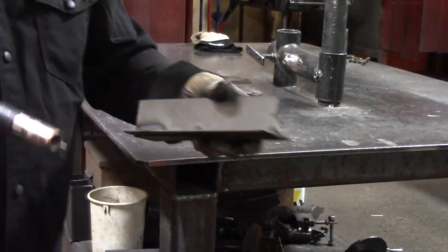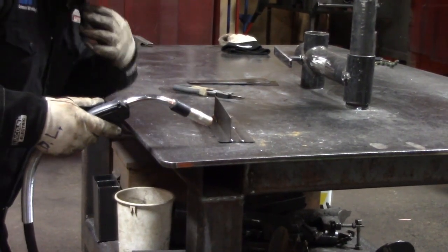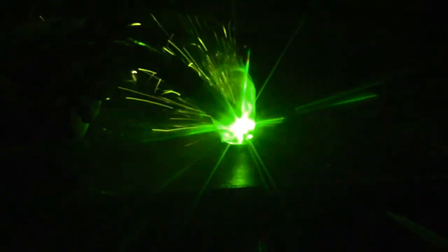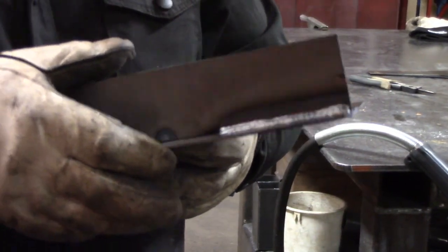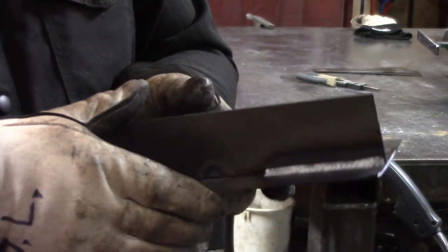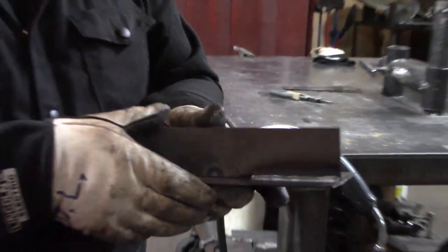On this side I'm going to do a push technique. Here's what the push technique looks like — that whip and pause. Again, let's check the backside to make sure we don't have any melt-through, and try to maintain about an eighth-inch fillet weld size. If your welds are too big, pick up the travel speed a little bit faster to put in that smaller weld size.